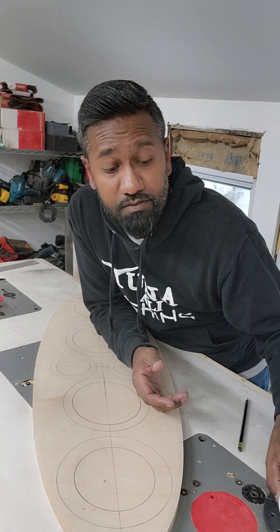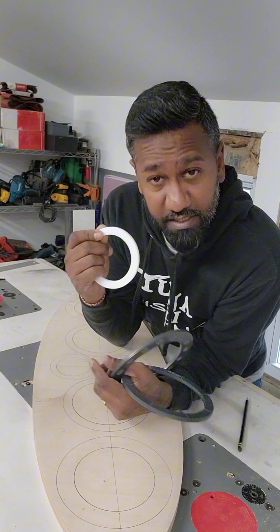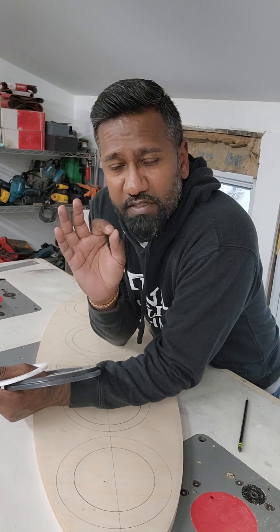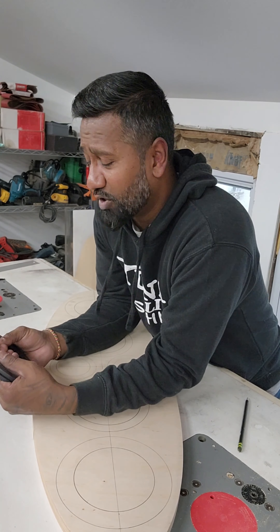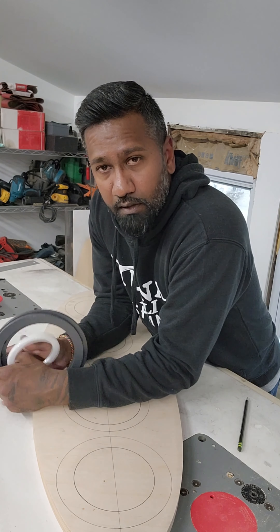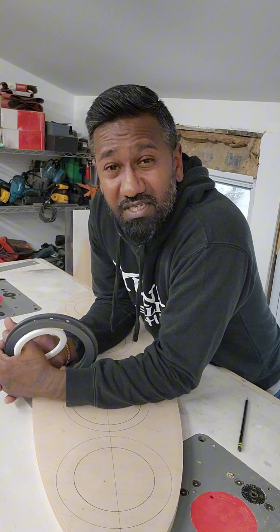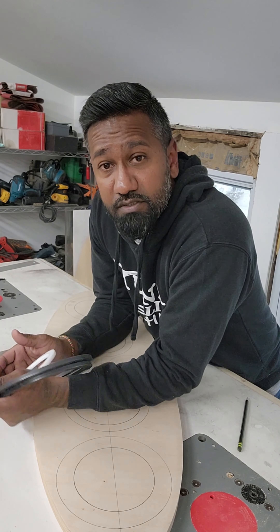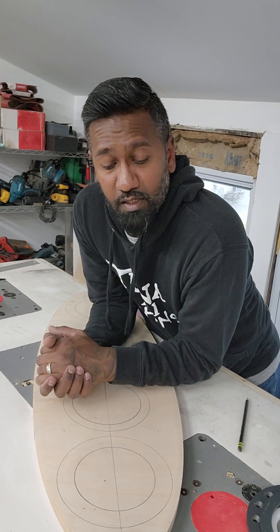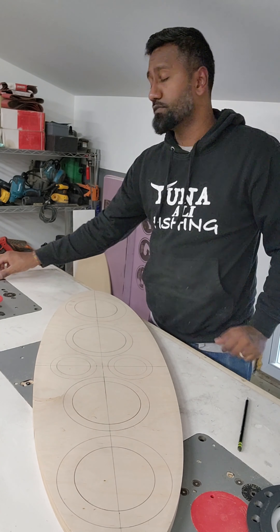Take your same templates, take that two-sided tape, stick it down, and then flush trim everything perfect. No jigsaw marks — no, no, no. This is the part everyone hates, believe it or not. I hate it as well. There's got to be a better way — it's called a CNC and we don't have one. So that's how you do it old school. Rough cutting, sticking on, routing, sticking on, routing — yeah, that's what we're going to do.